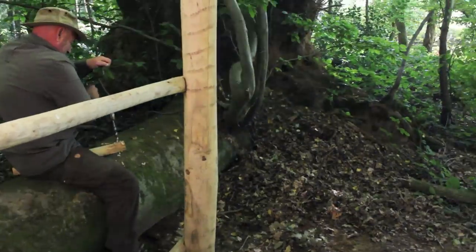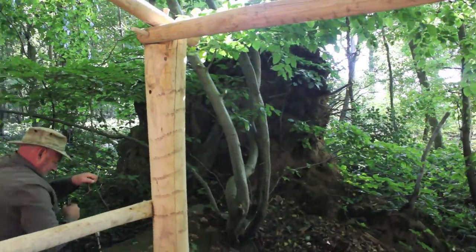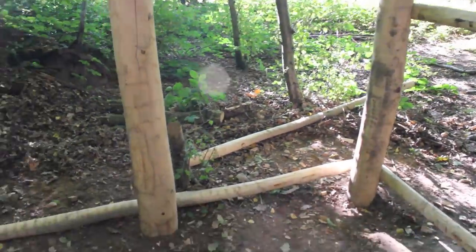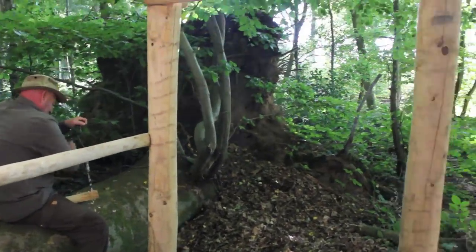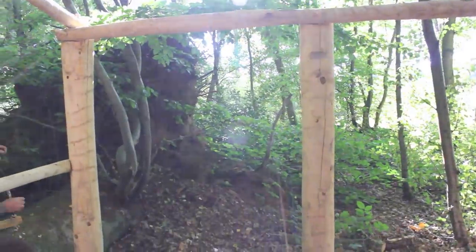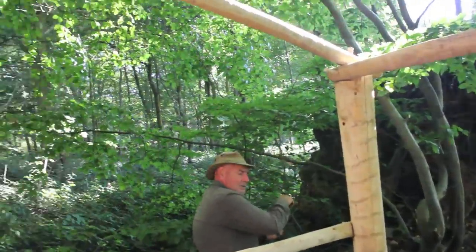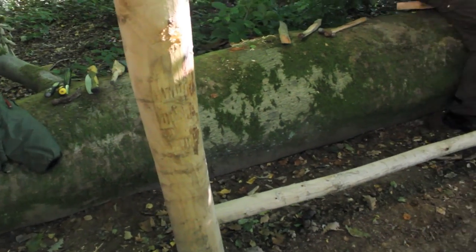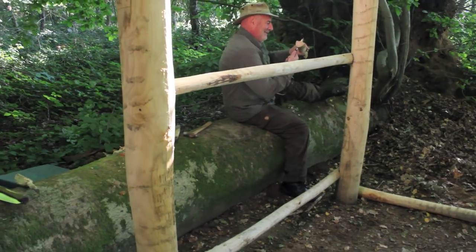So the following is what we want to finish on this occasion. In order to get the frame complete, we've got to put another two beams across, so along the bottom here and along the middle, and then that's the back complete. And then once that's done, a few things people have raised is, in order to have a solid structure and make this a lot more rigid, we've got to have some diagonal struts.